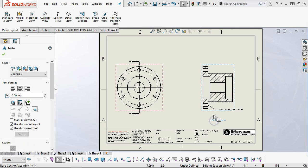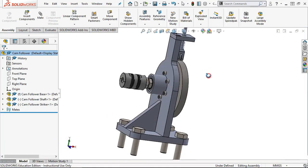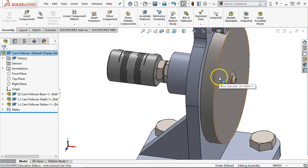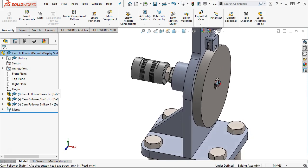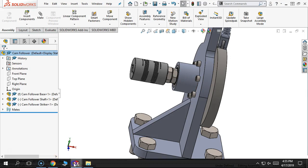And was that the, oh yeah, the tapped hole. So the assembly goal here, or at least as I saw it, was that you could take these 6 socket head cap screws out, loosen up the coupler, and everything would eject out the front. We'd be able to disassemble this as a complete subassembly and maintain it, do whatever we needed to do with it. So that's the reason that this piece actually ends up with the threaded holes.